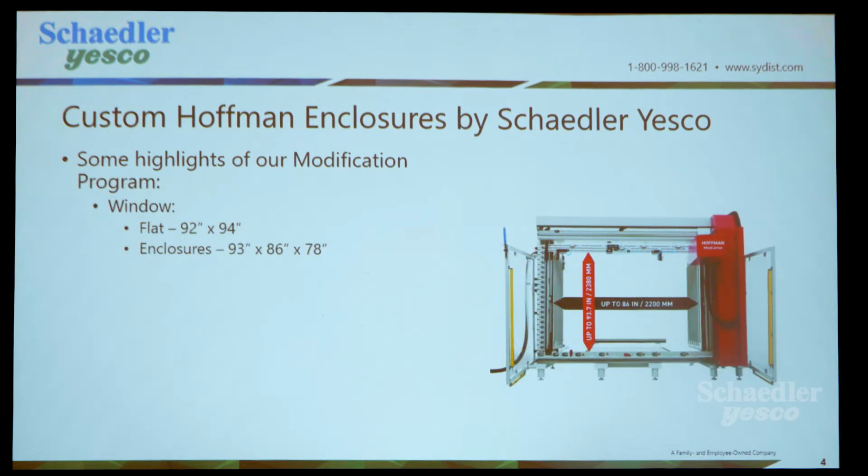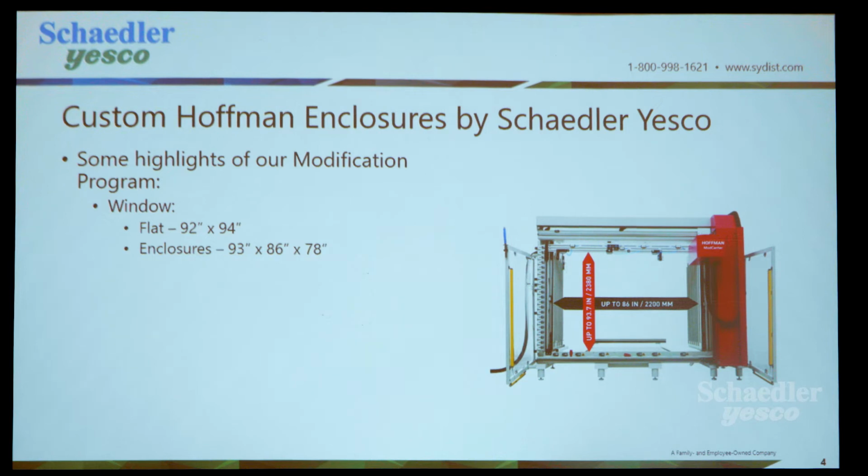One of the things we talk about is the window of the machine. A lot of people ask us, how big of an enclosure can we cut? And there's actually two different specs. There's the flat side, which we can cut up to a 92 by 94 inch flat piece of steel. And enclosure-wise, for a cubic type enclosure, we can cut 93, 86 by 78. So rather a large enclosure. And we have a gantry that we can move things around. So we know how to maneuver it and that type of thing. And actually, at times, we cut all 6 sides. So that gets to be interesting. And that's a picture of the machine there if you wondered what it actually looked like. That's it.